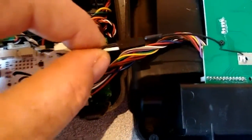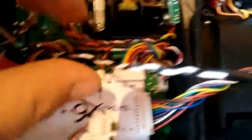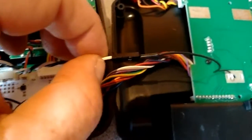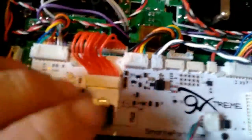Use the black wire only — leave the white wire doing nothing, leave it plugged in. The white wire was used when you plugged into the back of the DHT modules, so we don't need that with an XJT module. That's it — whack your board back together.